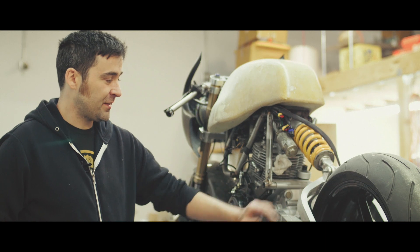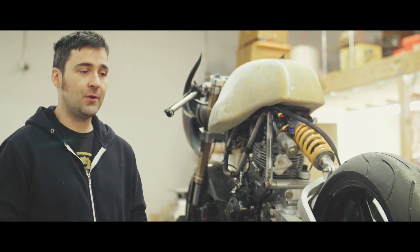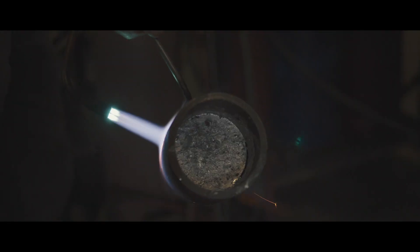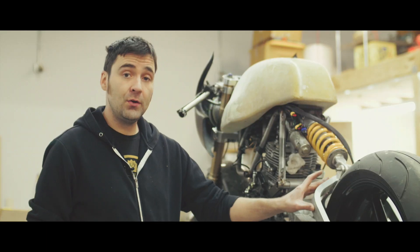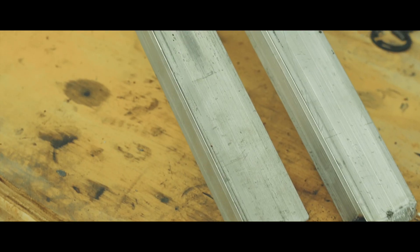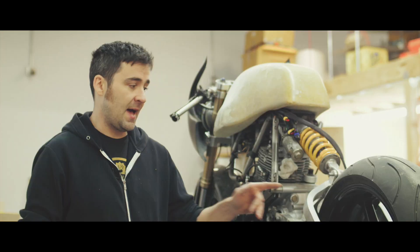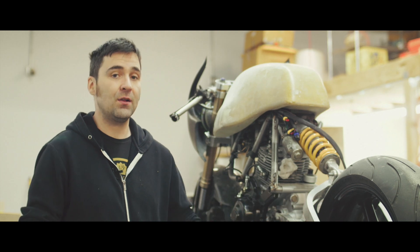What I tried the very last time was something I've used before for really thin aluminum tube: a low-temperature melting alloy — a bismuth alloy — and I filled the entire tube with that and bent it cold. That worked, and it allowed me to bend the tube cold, which means I didn't need to reheat treat it, which means the angle this finished at is the angle I needed.